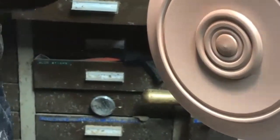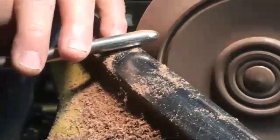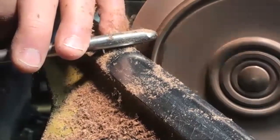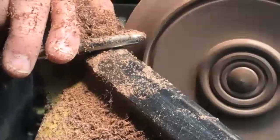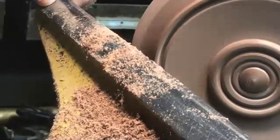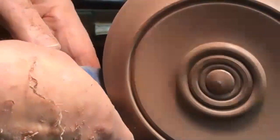I'm going to take a little more of that off with the tool because it's a lot easier. This is that D-Way tool that looks like a bowl gouge for me. I'll start with it rolled over so the flute is at nine o'clock, then go toward the headstock and pull that out of there - that gets rid of that little ledge. This is probably the part that will take the most sanding. Don't skip grits on the end grain because you're doing end grain and cross grain all the time.